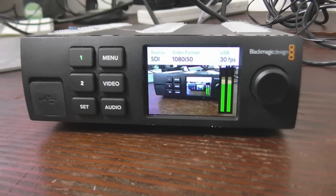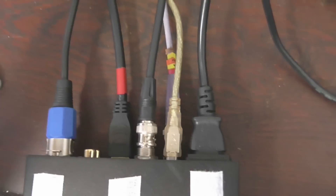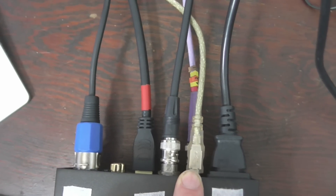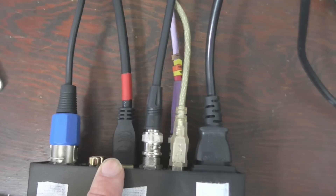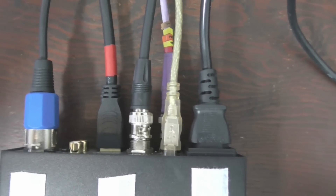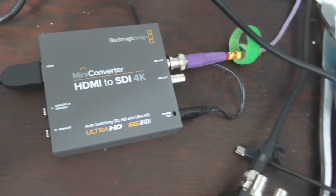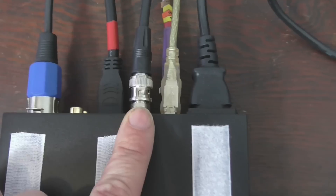It's well worth having — it's not a lot of money, invest in that, you'll want that. Around the back, it has a number of different plugs. We have power here, we have a USB 2 — this is plugged into the iMac and will be the way the video stream comes out of the web presenter back into a computer to be a webcam. We've got HDMI in. The camera that you're looking at now is an SDI in-camera, and the other camera is HDMI. The camera I'm currently using is an HDMI camera but we've got that going into a Blackmagic converter there with the purple cable, which is the SDI feed out.